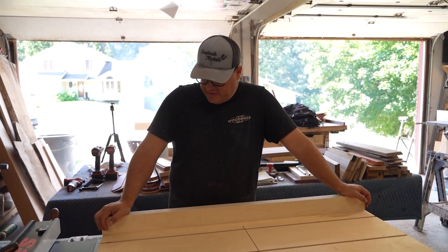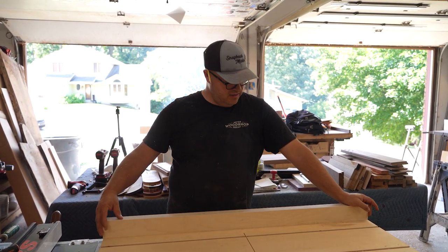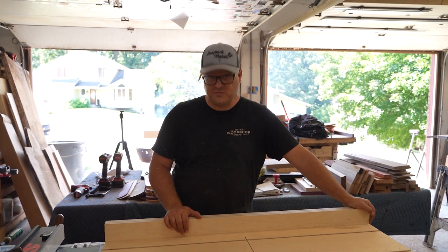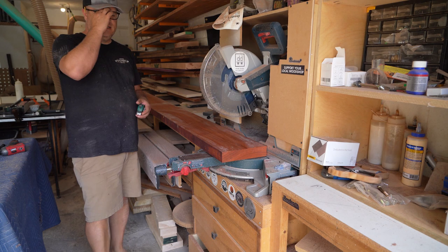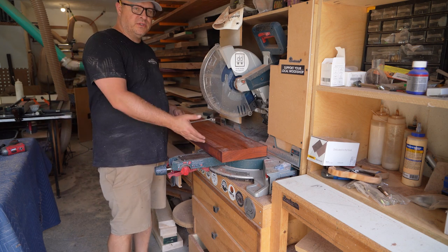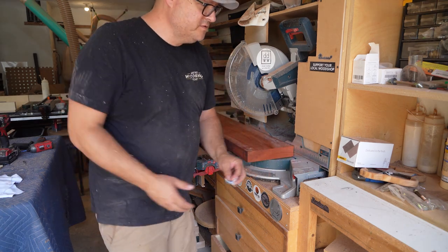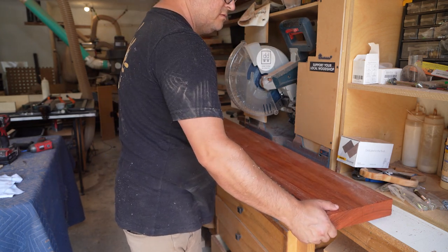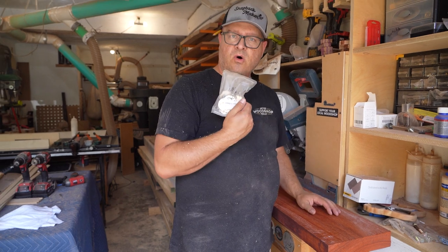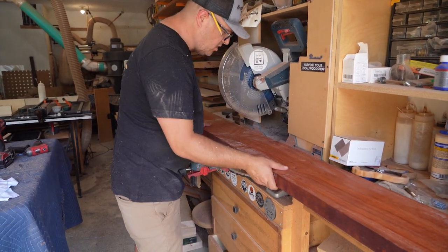So I made a bit of a boo-boo. This should be taller because I have a stop block that I'm going to put on here and some t-track, and I totally spaced it off. So it needs to be a little taller to accommodate the stop block and t-track — that's what I'm going to do now. The top of those rails are 43 and a half, so we're going to go a little bougie and use padauk. I pronounce it padauk — if you pronounce it any other way you're wrong. I didn't realize I had these, I just bought a whole other set because I couldn't find them and they're just right there. Organization is key.